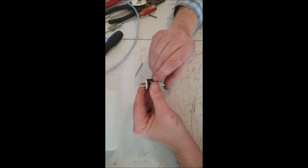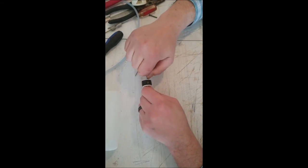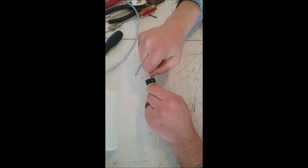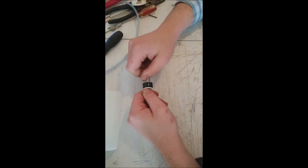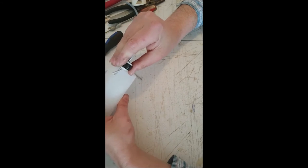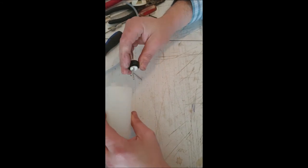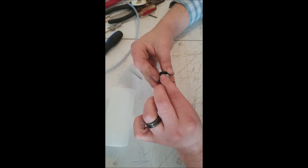And now what we need to do on our pressure side, we need to bend that up. And you can do it by hand. You can get some tubing benders if you want, but that's about what we want to do. That way it's towards the top of the tank. We'll also use that as a fuel gauge when we fuel our airplane up.